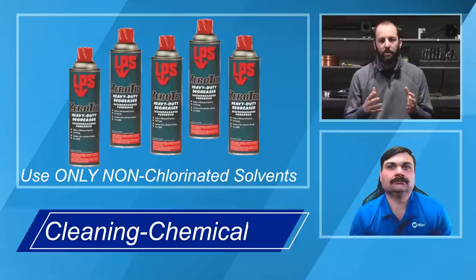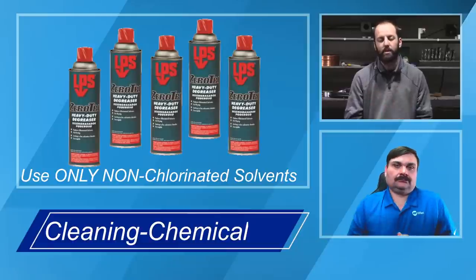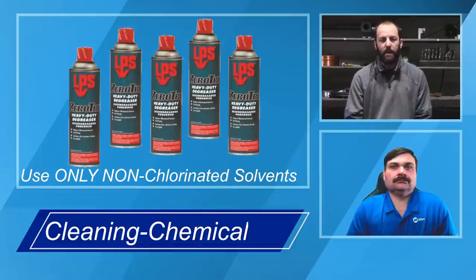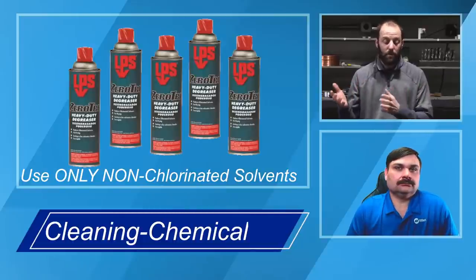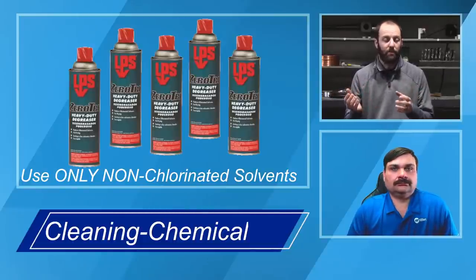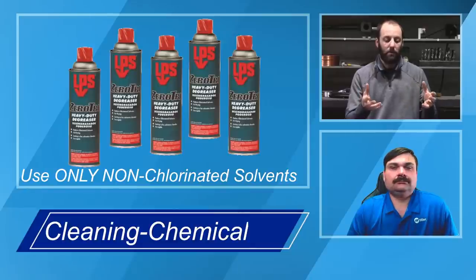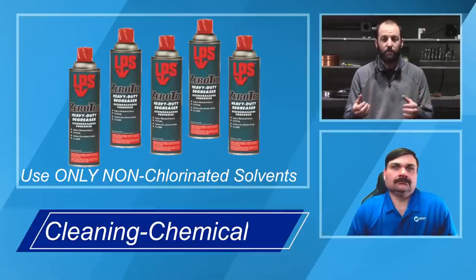So it really depends on the results that you're looking for. Obviously, any process has to be tested. They were doing some experimental things with their process trying to resolve some quality issues in order to meet some end quality requirements for the aerospace industry. And ultimately, a little bit of a trade-off, there could be machining fluids on that. There could be heavy oxides from the way that the materials are stored after it came out of a machining operation. And they felt that using that acid bath and then essentially washing it in a water bath was going to help reduce the amount of hydrocarbons or oxides on the surface.